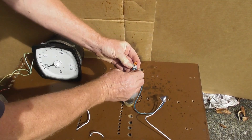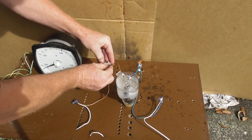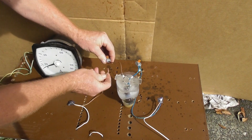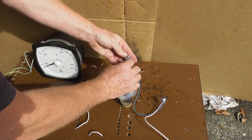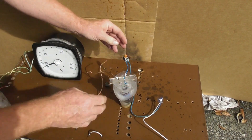The Wagos are not happy. The wires have fused inside. Mind you, they're only rated at 20 ampere, these things — at least on the blue one. I'll check if this one comes out. That one comes out. This one has really suffered a high impact. So that's stuffed.